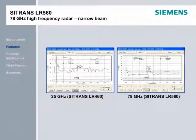The LR-560's noise level is much lower because the seams in the silo are not detected with the narrow beam. With the LR-460, the true echo was provided, but only after the auto-false echo suppression feature was used. Even then, the readings were not perfectly stable. The LR-560 produced this echo profile immediately after installation and graphical quick-start wizard setup — no fine-tuning was required.